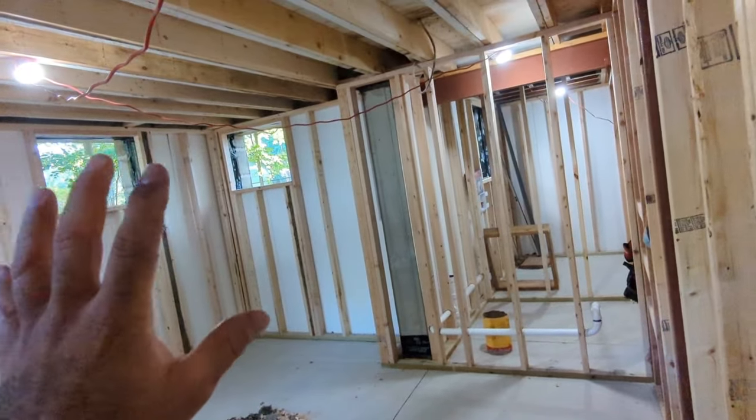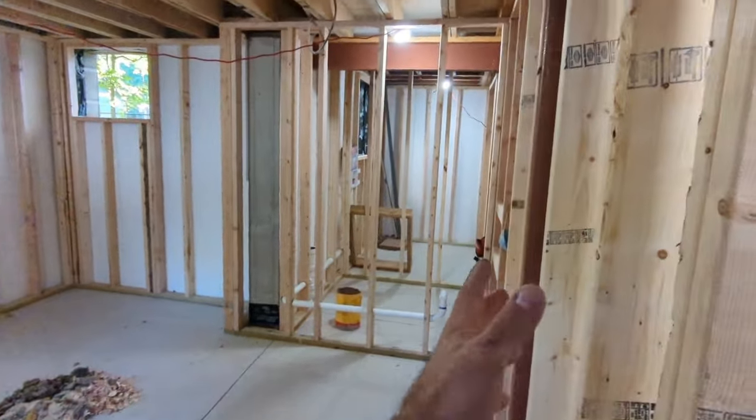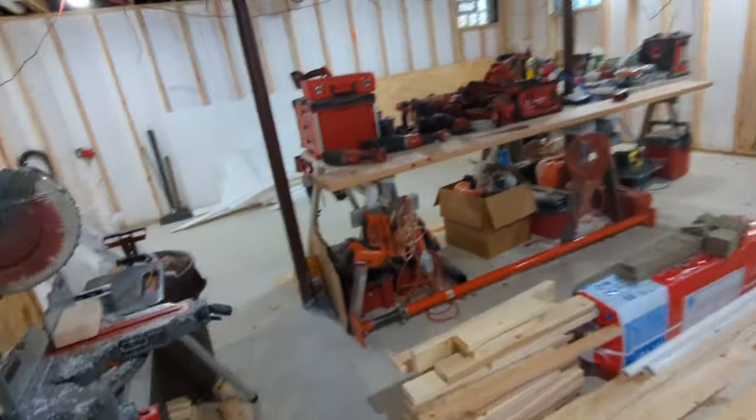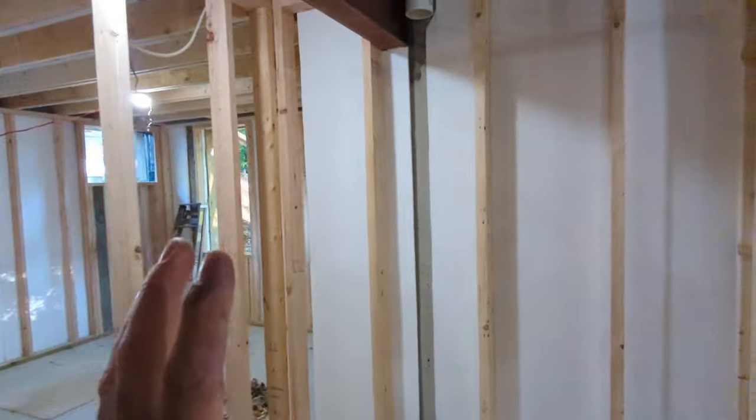That's not going to work. It's cheaper with the lights that I bought, at least for the hardware. We'll put switched outlets in the ceiling and get them all right, and then it can just plug in the lights for here in this room and over by the laundry and whatever. Underneath the stairs and in the bathroom, all switched outlets. But the thing is, I'm going to think about it well enough so that the outlet locations are on a nice layout for LED can lights or something.